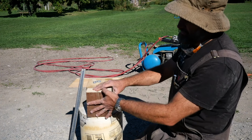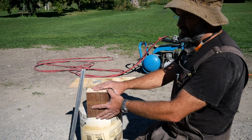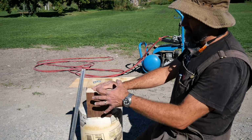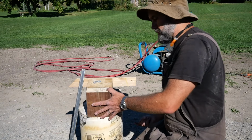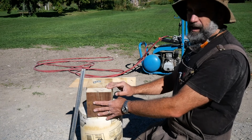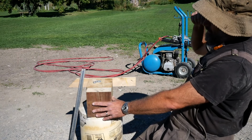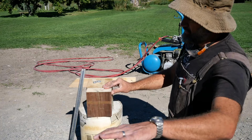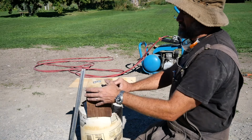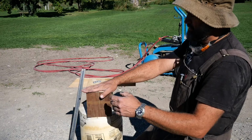My understanding is that the amount of shear force the carriage bolt itself provides is bananas. It would be one of the strongest components of this whole assembly from the footing up through. So that's what we're doing here, essentially creating some additional bearing edge, because our beam is going to come up to here, then another beam going there. There'll be a splice here, and then the connecting beam that runs across the entire width of the building is going to rest probably starting about 1.5 inches here and then across this. So this is just some added insurance.